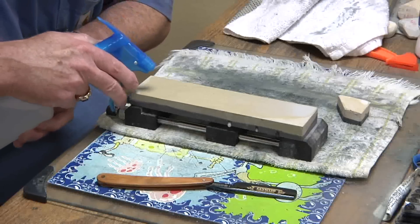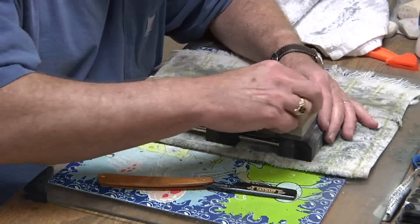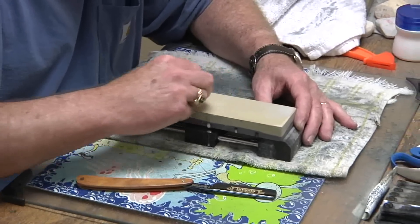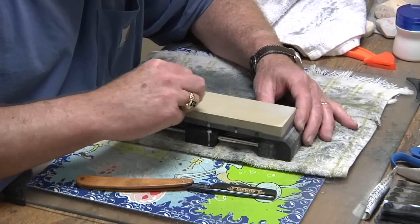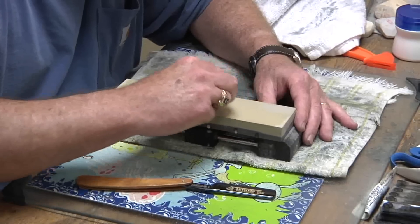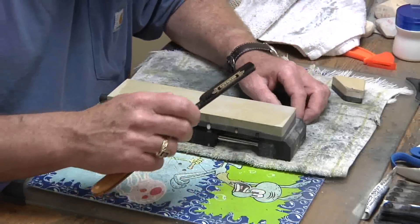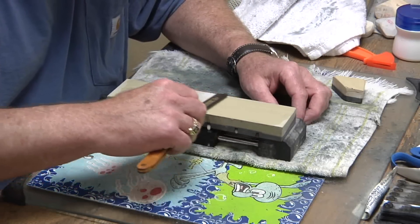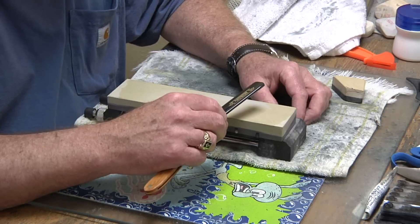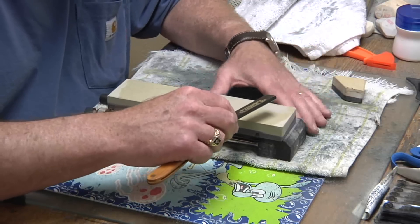For the second level I'm going to water my slurry down. I've knocked some of it off from doing the X strokes, so I'm going to work with what remains from the heavier stuff and keep it a little bit thinner — what I'd consider a medium-type slurry. With the medium slurry I'm going to start off with 40 circles with pressure both ways, followed by 40 circles with no pressure, and then 5 or 6 X strokes with no pressure.